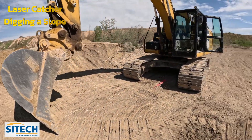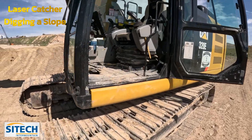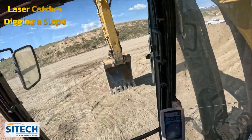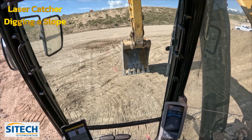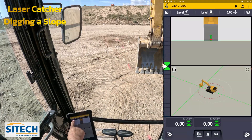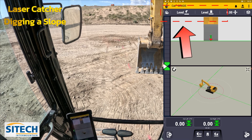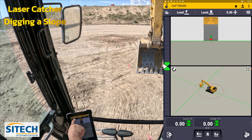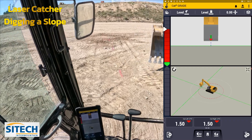My top is there, then I'll bench down from there. If you leave the excavator at zero percent slope, it's going to staircase every time you re-reference the laser. Now in the excavator, on the screen you'll see at the top left you've got level and level — one is for main fall looking at the bucket sideways, and one is cross-section left and right. You want to set the main fall level at two percent to match the laser. If we don't do that, every time I re-reference the laser as I move the machine back it will staircase and reset.